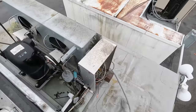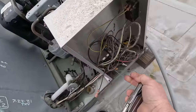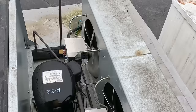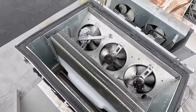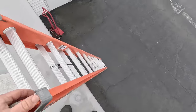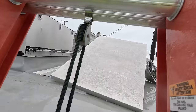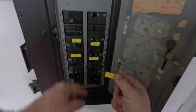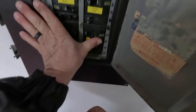We can cycle that — I pulled the terminal off. Let's see if that fan starts on its own. He said it was wanting to not run. That seems pretty peppy to me, like it's got some good torque. I bet he was seeing that one, and that could very easily be the fan control. Let's go kill the breaker to this thing. I don't want to blow warm air in there and make it any more humid than what we already are. It was not labeled, so we had to flip some breakers until we finally found it. We're going to go ahead and get that one labeled — walk-in cooler. As you can see, none of the panel is labeled anymore.